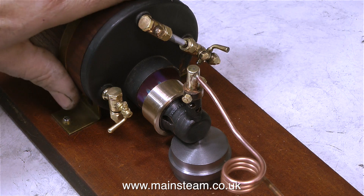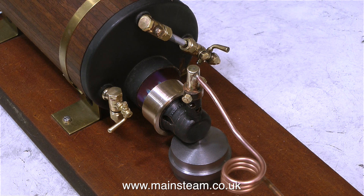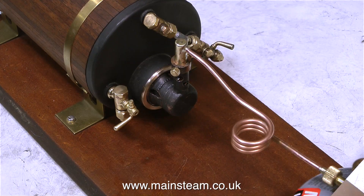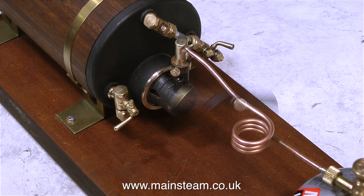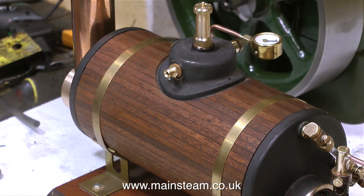If you move the ceramic burner away from the boiler's flue tube, obviously the howling stops, because there isn't loads of air rushing in and being accelerated over the small openings in the burner. Once the gas pressure drops - which it does very quickly as the tank chills - the howling tends to disappear, but so does the heat. It took quite a while before I got any steam at all out of this boiler - I think it was possibly about 25 minutes. This is a very small ceramic burner, but eventually it started producing steam. Not a lot of steam, but steam nevertheless.